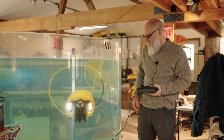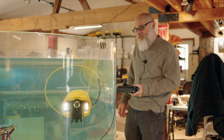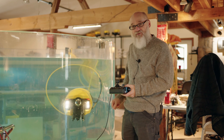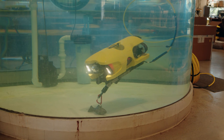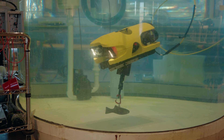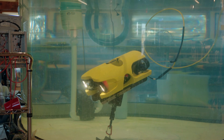Four thrusters keeps it light, small, and quite a bit less expensive than the Defender. Ally can be used with batteries — we have the nickel metal hydride and lithium 300-meter batteries. We use a larger squared-off float to float them. We use the Reach Alpha rotate and open-close gripper, which fits right on the swing arm mount. You can lift up to 21 pounds. That's Ally.